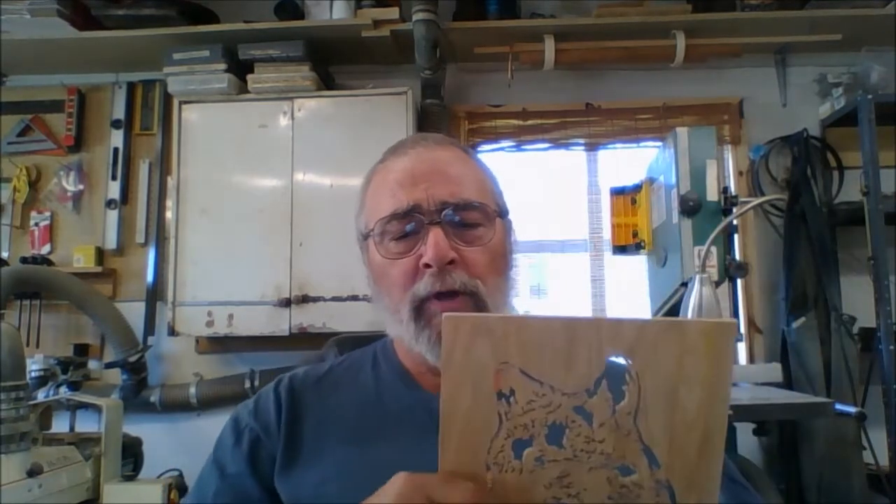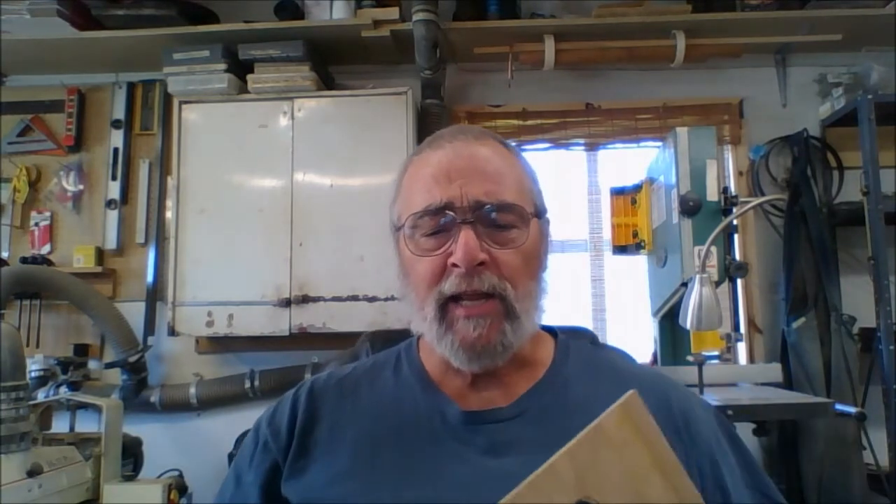I just think it's going to be great. We don't just go out and buy a piece of oak this wide and plane it down, sand it down to get it to the size we need at a quarter inch. We actually have pieces of wood that we buy — and I don't know if you can see it — but we take scrap wood we get from a supplier, square it up, plane it down, rip it down, and actually get it down to close to a quarter inch.